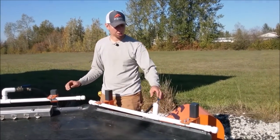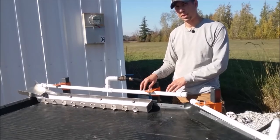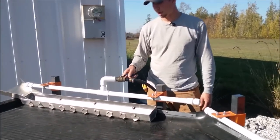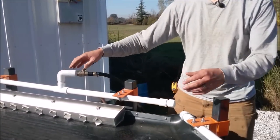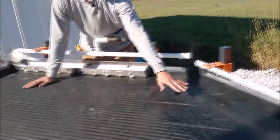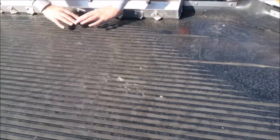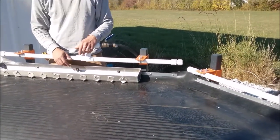There are two water bars on the shaker table — one over the cleaning plane and one over the distributor trough. They're made of PVC, so they're very easy to replace if damaged or broken. The only adjustment on the water bars is these valves, which can be tuned to adjust the amount of water on the shaker table for both the distributor trough and the cleaning plane. What we've found is the shaker table needs to be completely covered in water — there should be no dry spots, no uneven spots. You don't need any more water than that. If the shaker table is completely covered with water and the water is nice and evenly distributed with no rivers, that's really the optimal condition.